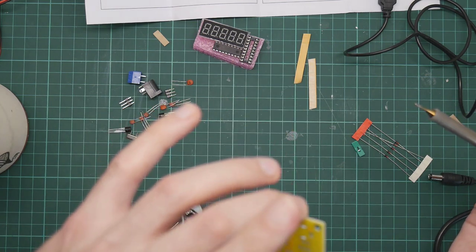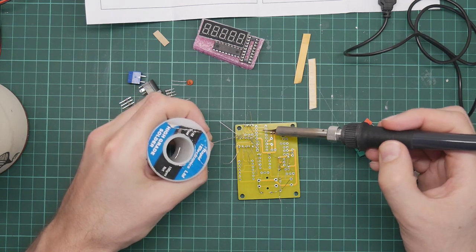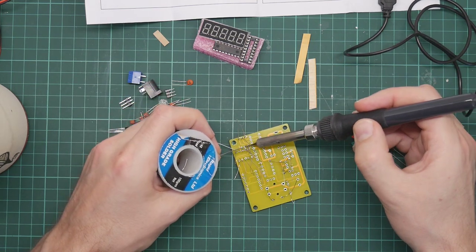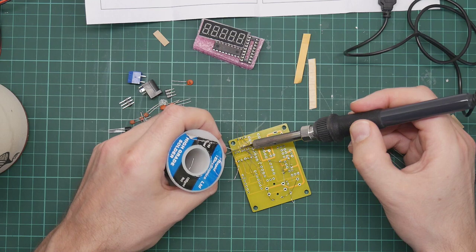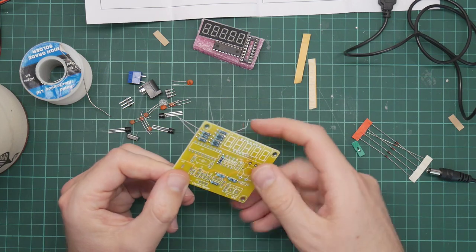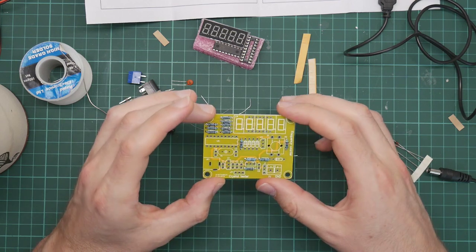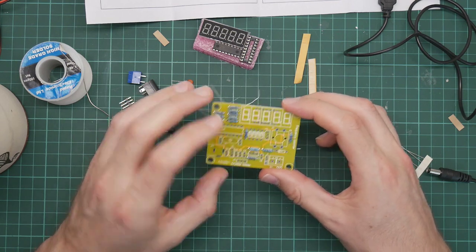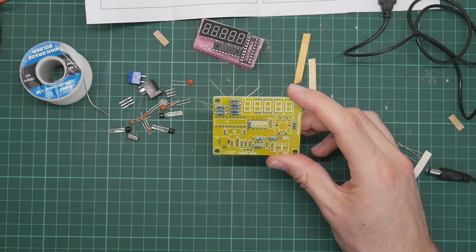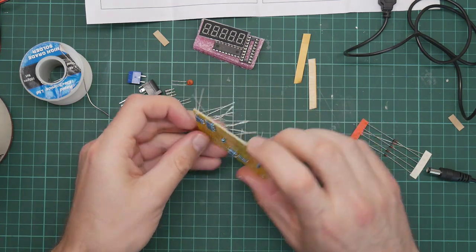And the way this works is that probably only one digit is displayed at a time, and the PIC will rapidly cycle through all the digits, displaying each one in turn for a brief moment of time. And persistence of vision means that you can't actually tell this. It looks like a constant display, but because only 8 LEDs are ever energized at one time, you only need 8 resistors. And, just as importantly, far fewer connections to the module.